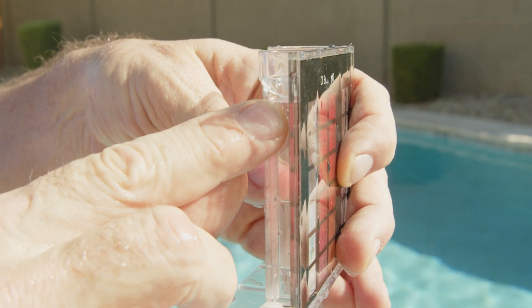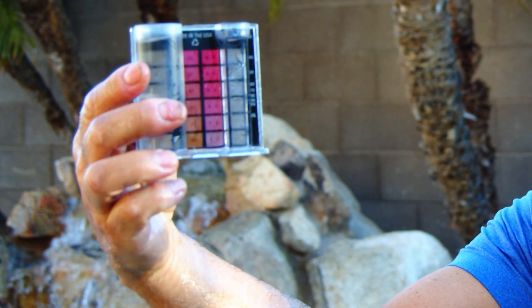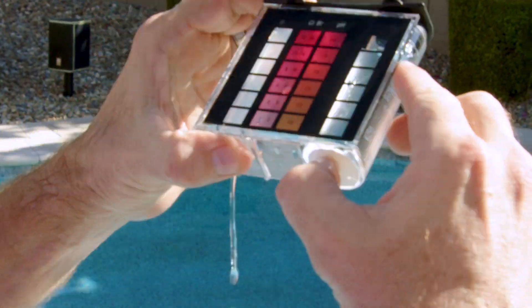For test kits, remember to always measure the water at the bottom of the curve at eye level. Add reagent drops with the bottle completely inverted. Try to put the sun at your back and use a white background for more clarity. Swirl, don't shake. Invert, don't shake. And take your time here. Using the nozzle bottle with test kits keeps you from going back and forth to the pool.